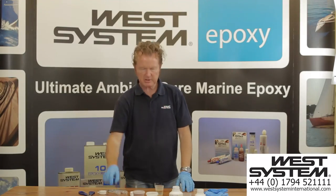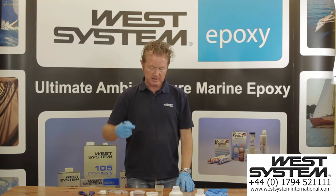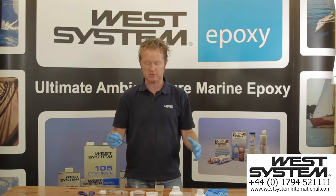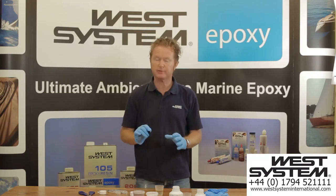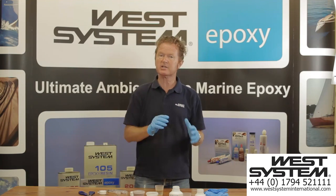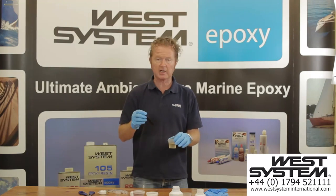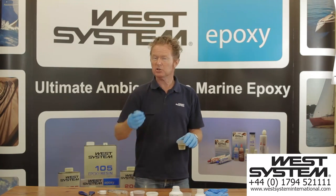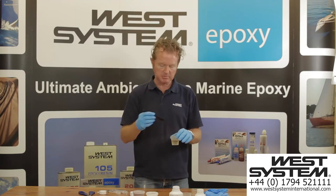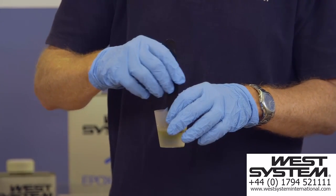It's important to mix the resin and hardener mix thoroughly. It's very important to get a completely homogeneous mix of the two materials. They look very different together. The hardener has a slight amber colour and the resin has exceptional clarity. It's important that you mix these together, because without that, you cannot guarantee that West System will cure. It must be mixed thoroughly. We suggest that you mix for 3 minutes.